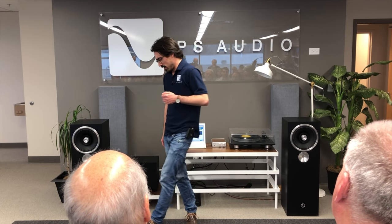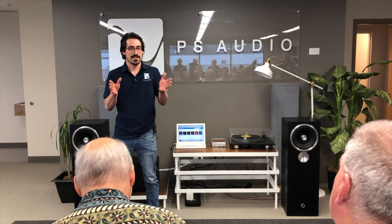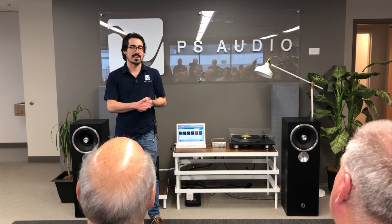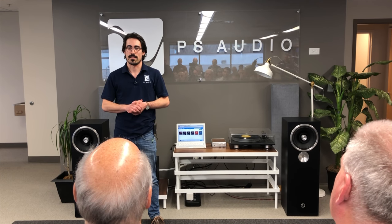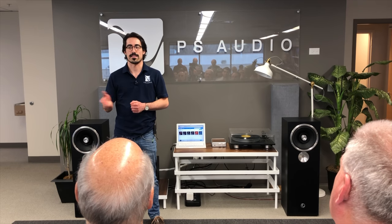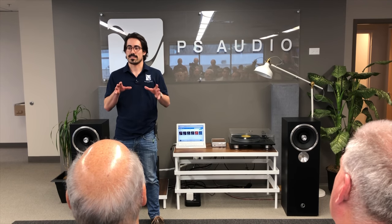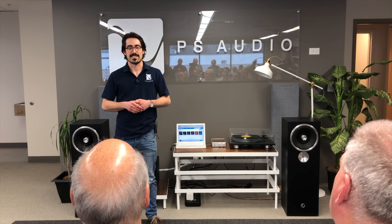And so I had to think about what exactly in a Phono stage makes that occur. Like what happens in an amplifier that makes you feel that way? That's a big question, because I could create an amp that maybe sounds like the integrated amps. Maybe it has the same types of distortion or characteristics of sound. So I had to think about, from a measurement standpoint and from a design standpoint, what matters. I came to the conclusion that open loop linearity, that's when you don't have any feedback, is the key.